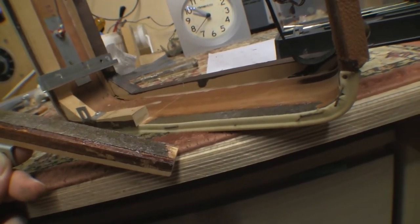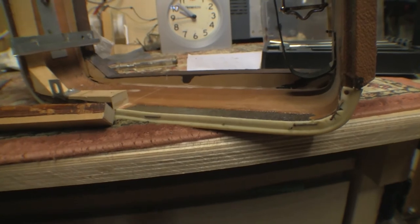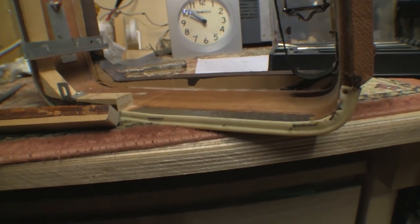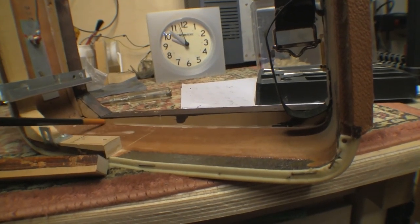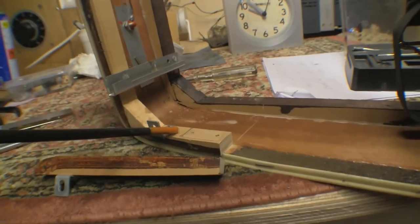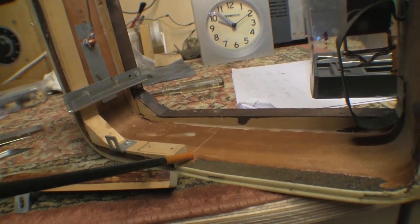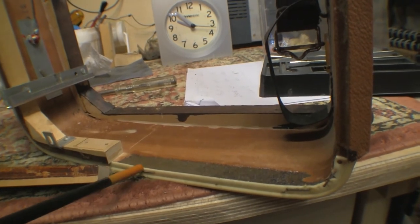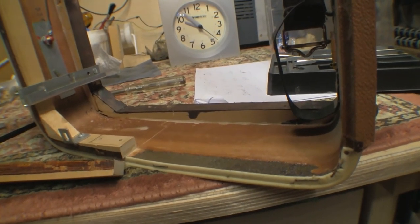And so I thought there's no point in trying to just put an epoxy or something there, so I'm just going to try it with contact adhesive, and then when I get it back in place, I'll run another piece of wood glued across the entire length to try and support it, because, for instance, here it's glued okay up along here, so I actually cut it here so I could take it out. So I'll put, as I say, contact adhesive here to try and hold it, and then running along the back, I'll glue another piece all the way up, and hopefully that'll hold it.